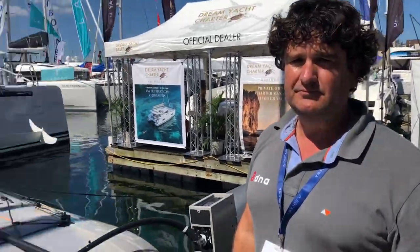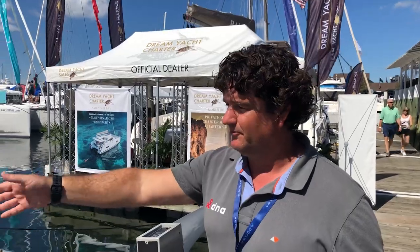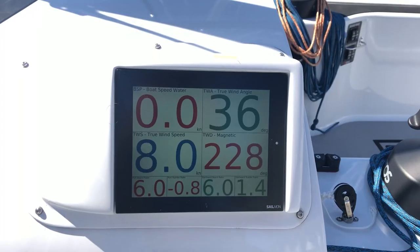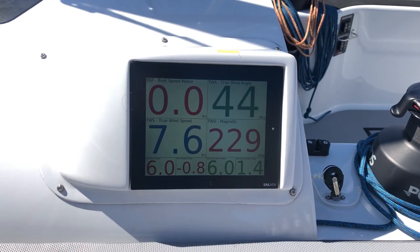So very easy foiling for a normal crew. And how do you know which setup to get right for the foils? We have a standard setting for the teams that are sailing, but nowadays thanks to the Sailmon system we can record all the rake angles on certain tacks, so we're learning while sailing. In every sea state and wind speed we now know what kind of numbers to pull on the rake settings for the dagger boards.